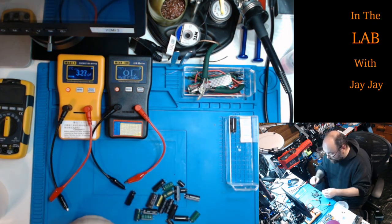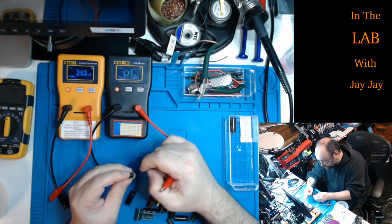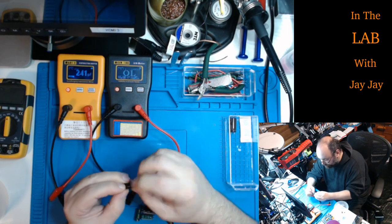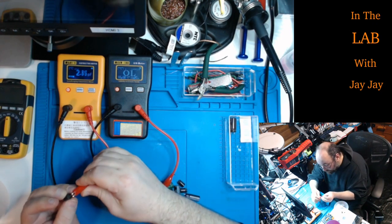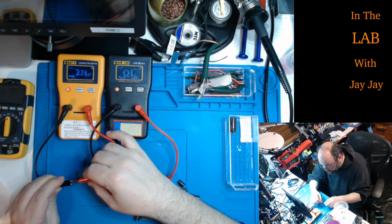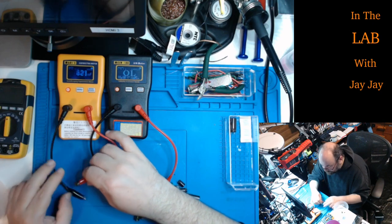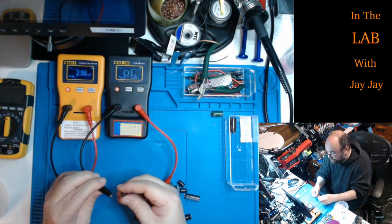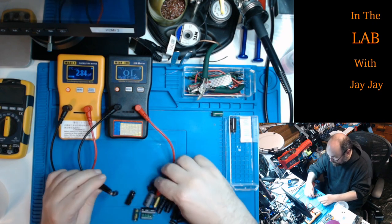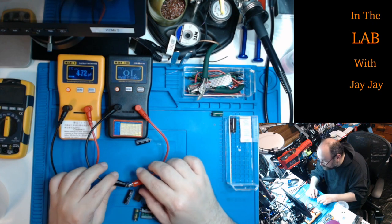All right, let's do all the aerogels. These are all the clock capacitors out of the old Xboxes. They're notorious for failing, so I'm not expecting any of them to work. But let's see what we can read off them. All right, this one's measuring a couple of nanofarads, which is not very much. Certainly not like one farad, which this thing is supposed to be. And open circuit as well.